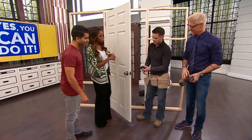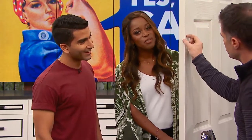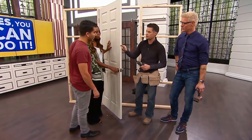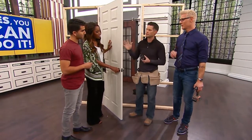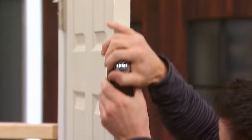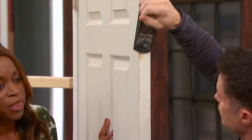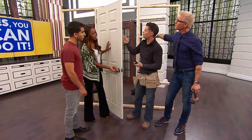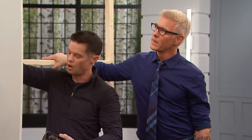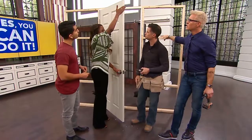It's like a cheese grater — that's exactly what it is. In this case, it's a hollow core door, so we've only got about a half inch or three-quarters of an inch of solid wood to deal with. If you're planing more than that, you need to find another door. We just run the planer down the edge, shaving until the door closes again. If you need to do a lot, take the door off the hinges by popping out the pins — leave the hinges in place — then set the door down somewhere secure and get some leverage.